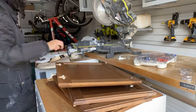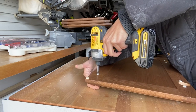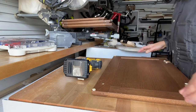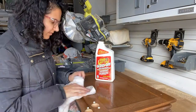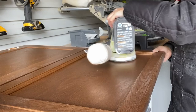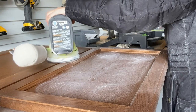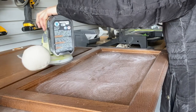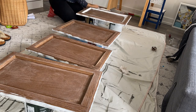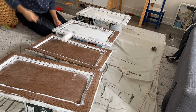Painting your doors is a great way to save money when doing any upgrade to your kitchen, laundry room, or bathroom, and it's actually much easier than people think. You don't need a fancy paint sprayer — you just need a roller and a paintbrush. Start by deglossing the doors to take off the shininess, then go in with a P60 or P80 sandpaper and scuff up that top layer so your primer can adhere. Next use a strong bonding primer. Don't use a paint and primer in one — you have to use a good primer. I'll link some of my favorites below.